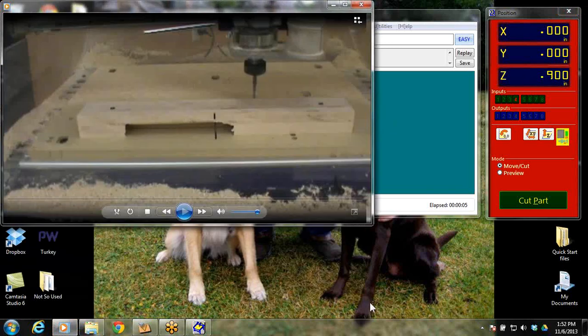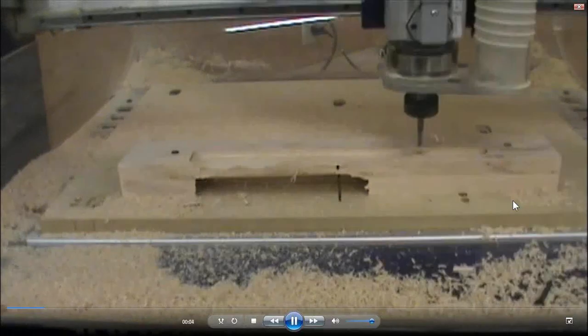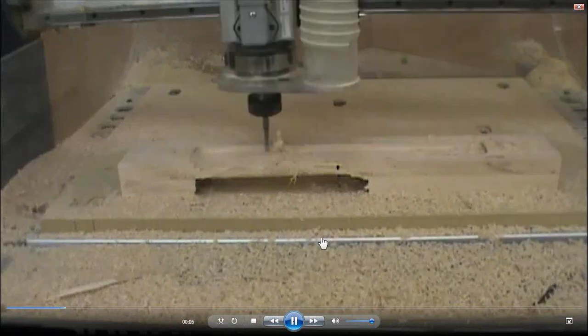So to machine the bottom, it's the same thing here. It's the roughing toolpath, but let me pause it. Notice this blowout here, this tear out. It was taking out big chunks. Well, depending on the type of wood you have or the grain, that could be a big enough chunk that one could shoot out and snap a bit. It could catch and make you lose position. So I like to have a wider board, a lot wider than the part, so it stays within the board.